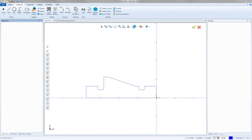And the benefit of having a solid model for just about any scenario, whether it's milling or turning or anything that you do, is when you launch the simulation, having a solid model turned on inside of our CAD window here kind of unlocks the workpiece option. So we can actually see our part inside of the simulation. That's another little thing. If you ever launch your simulation and it has a weird blinking bar that pops up, that's usually caused because the solid that's trying to get brought into the simulation is broken into a bunch of surfaces.